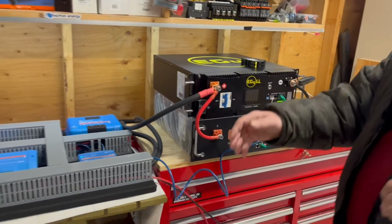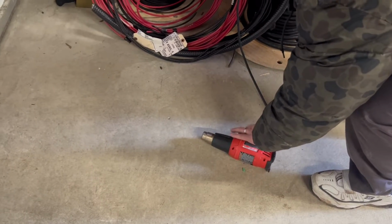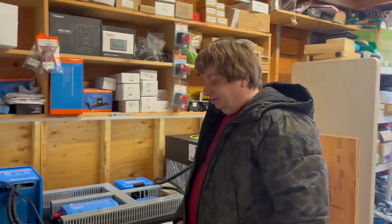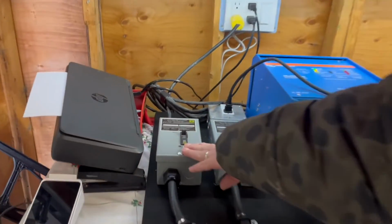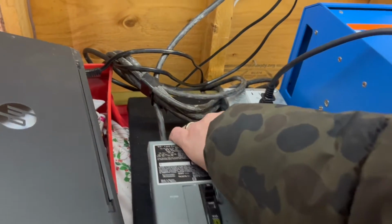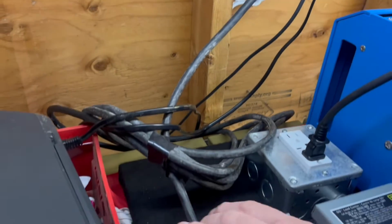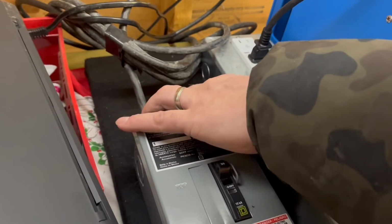Okay, now we're just going to turn this off because I'm really pushing my garage outlet right now. We only have 15 amps and we were pushing over 2.1 kilowatts through it, so we don't want to trip a breaker. But this is how we designed this system. Right here, for your RV, you bring your shore power into here. And what I've done is just temporarily connected a regular outlet for now until this 30 amp breaker. So that's for your 30 amp shore power in.